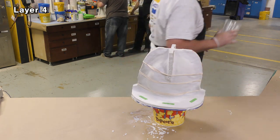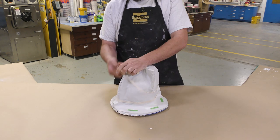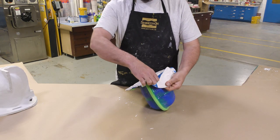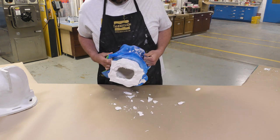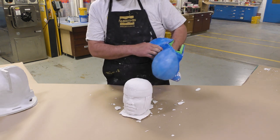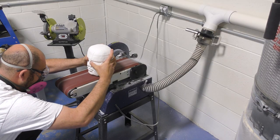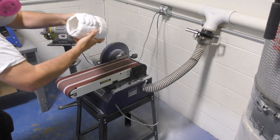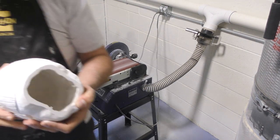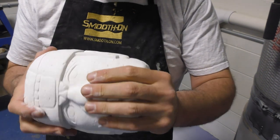The material is now allowed a full cure of 35 minutes. After a full cure, we can demold the DUOMATRIX NEO casting by simply peeling away the one-part brush-on mold to reveal the final casting of our sculpture. There may be thin sections of DUOMATRIX NEO around the opening that can be broken away easily. For the thicker section, use a belt sander — make sure to wear a respirator or dust mask when sanding these products. We finish the casting by sanding the bottom edge to a nice flat finish. The casting thickness is overall pretty even throughout at about 3/8 of an inch.